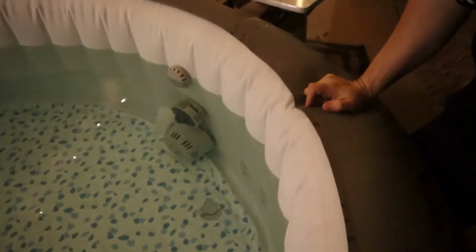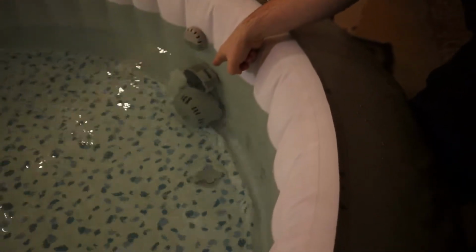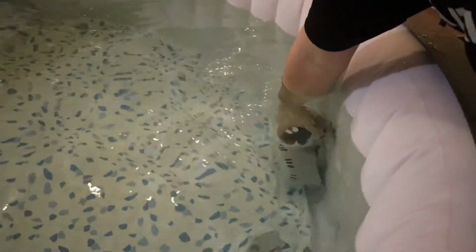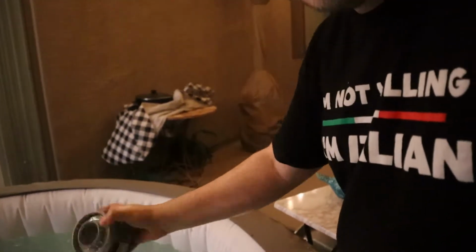Second thing you gotta do after doing the filter is you got this tablet housing that's right there. It sits above the filter. Now this isn't screwed on, it's just on and twisted. So we're just gonna twist it and pull it off. Right there. And just like the filter housing, we're gonna drain it out. You shake it around and you should hear your tablets in there. I don't hear anything, which means my tablets are gone. So time to replace them.